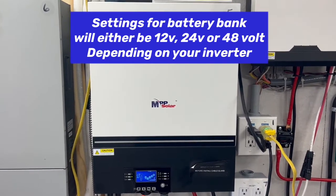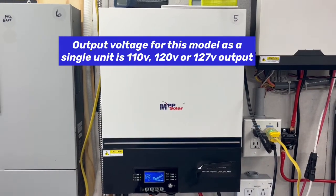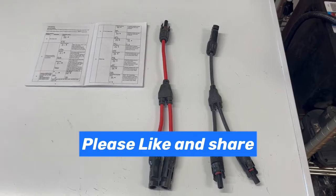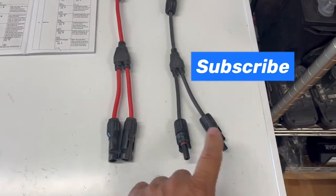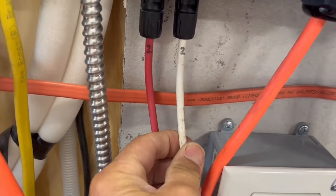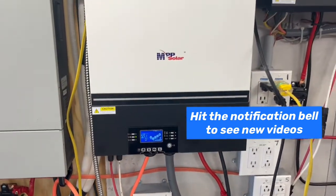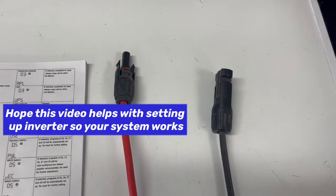You can do strings in series, and when you go to do that, you could do like two strings of six panels in series. When you do that, you would take and parallel them together using connectors for the positive and the negative. You bring your two positive leads into one and come out with just one, and your two negatives come out with just one. You have two MPPT chargers on this. We have 12 panels connected — six in series, another six in series — and then we use connectors to parallel them together and bring in just two wires.